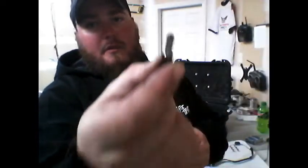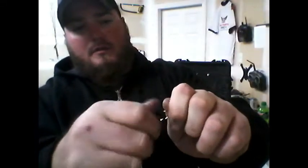This is the power supply that is for the TV, and this is a 12 volt 1.5 amp power supply, and it's got of course the barrel plug. So I went down to Radio Shack, and first thing I did was I matched up the barrel plug. This is just simple, you unscrew that and you solder it on. And I got the female receptacle for that in a bulkhead fitting.